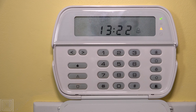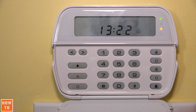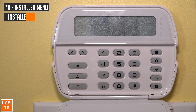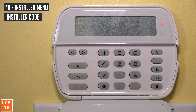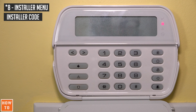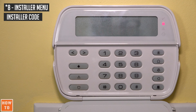If you want to permanently deactivate a zone on your DSC Power Series keypad, you can do it by going into the installer menu, which is star 8, and then input the installer password. The default one is 5555. If you don't know what the password is, you may ask your installer. If you don't have the information, the only way to get into that section will be to do a factory reset, which means restarting from the very beginning. I can show you how to do it in the video on the upper right corner.